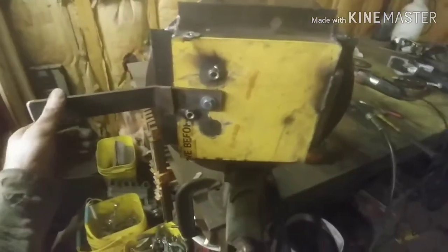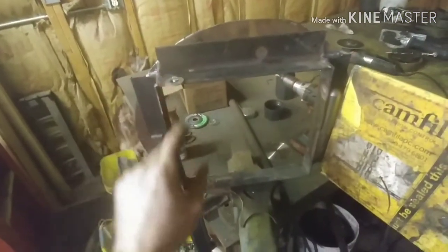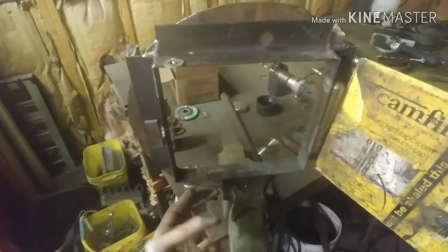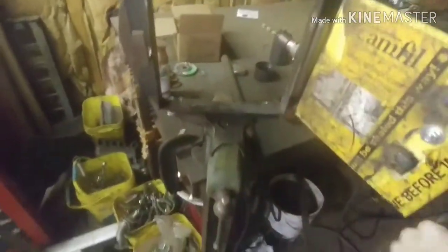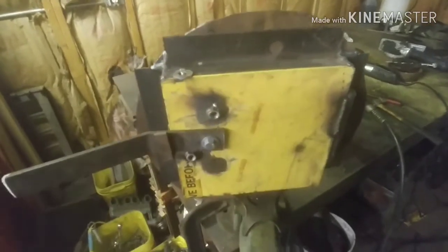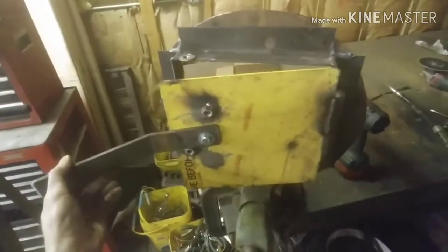Hey guys, another door update. I added a washer at the top and the bottom of the door — a couple little tacks — so if the door becomes slightly sloppy in the hinge area later on, you can tap these washers with a hammer to tighten up the door at closing. And since they're round, it shouldn't really affect the door closing if it were to friction fit as it closed. And I added two whiz nuts, three eighths sixteen nuts, as a latch stop so when you open it the latch doesn't fall down.